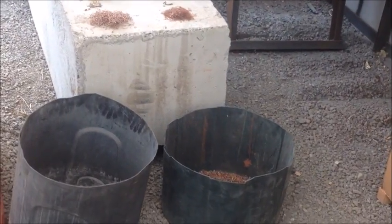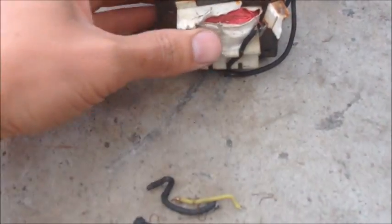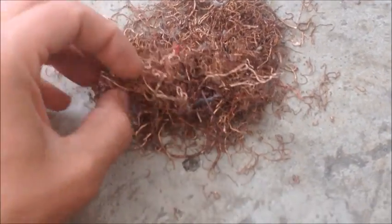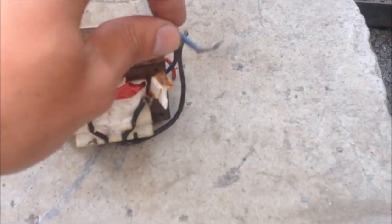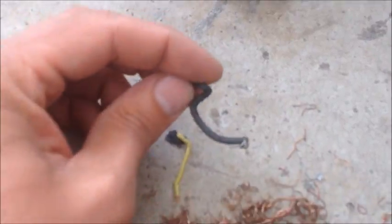We'll go over here and take a look at the copper portion now. We did it in two steps — we did the small transformers first. Here's a look at one of the small transformers for scale. What we found is that the small transformers have really, really fine wire in them. The zigzag did a pretty good job of getting the paper out of the wire. We were having a few problems with some of the insulated wire just hanging off. We didn't clip any of that off. The hammer mill doesn't strip the insulation, so this is heavy enough to fall down through with the copper wire.